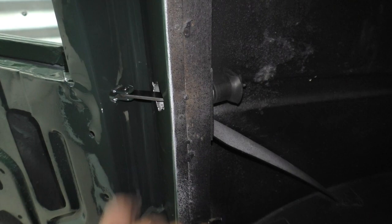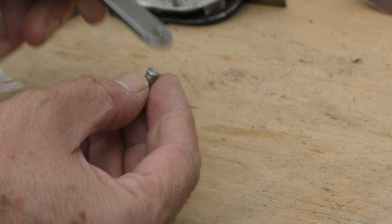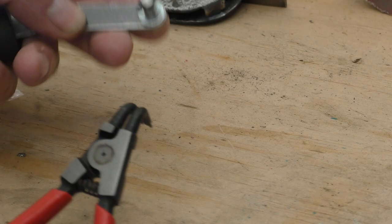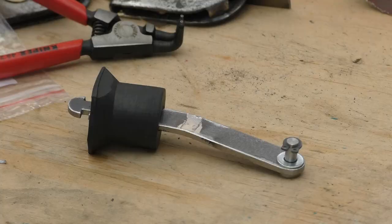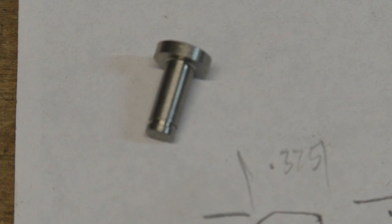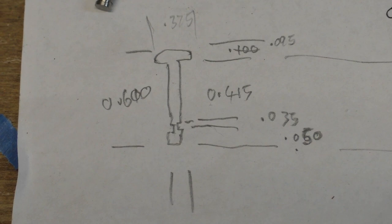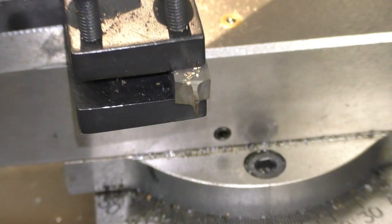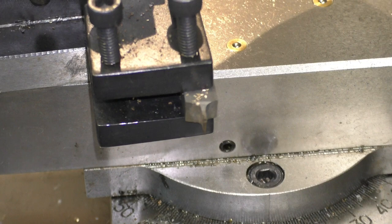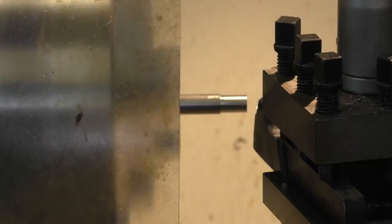Here's my first attempt at making a little retaining pin which fits through the check strap and also through the little bracket on the door. The idea is I'll put a little washer on and then a spring circlip. The task now is to make three more of these pins, so to help myself out I made a very rough drawing. I used 3/8 inch diameter stainless steel and turned the pin section down to 5mm because it was easier to get 5mm circlips. I've ground a little high speed steel tool to do the groove, ground to the width I want, and then do the rest of the turning with another high speed steel tool bit.